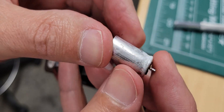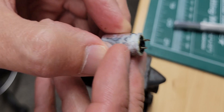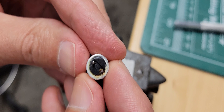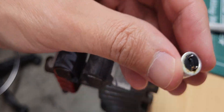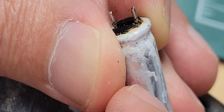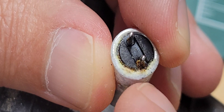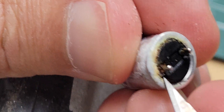Now it's got all this white stuff in here — I wonder if this thing did leak, or if that was some of that glue that started eating away at the aluminum. It looks like it's all corroded, and I wonder if that glue is conducting between the pins, or if the corrosion just went inside. I'm going to take the razor and just remove some of this stuff.